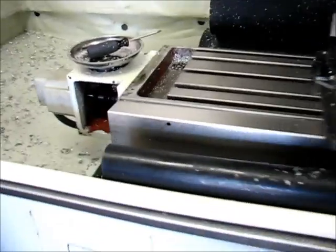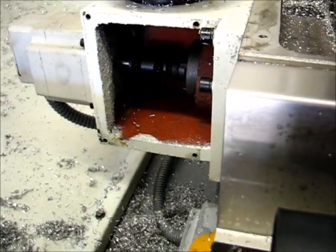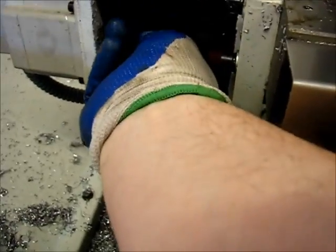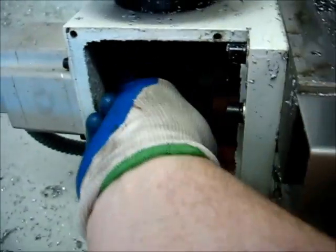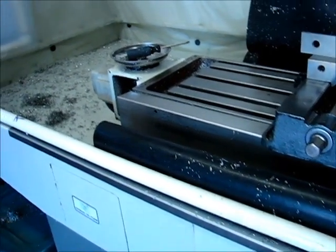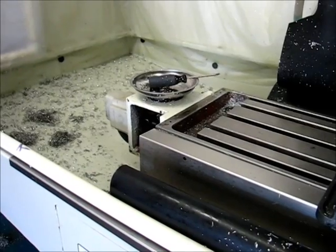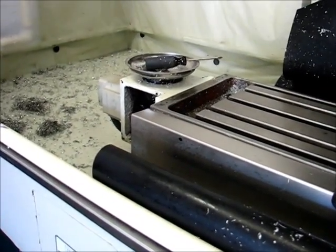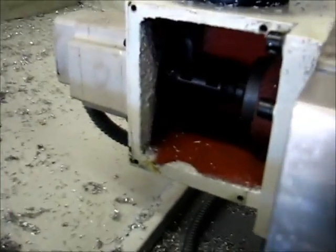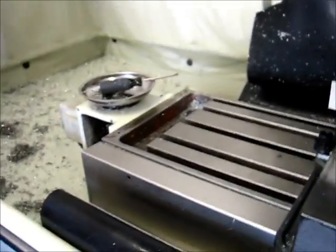I've disconnected the coupler — it's still on there but it's loose, so it should be able to turn fairly easily. There's power to that axis right now so it shouldn't be able to turn, but I'm turning the coupler without turning any other components on the shaft. Here's the Y once again, here's the X — and there's the flat spot there on the stepper motor.